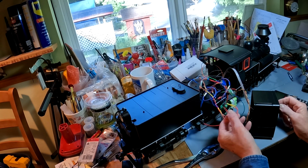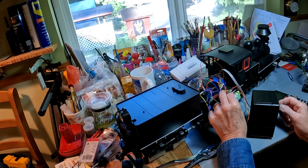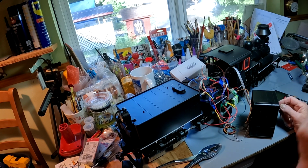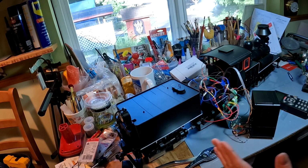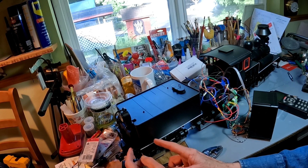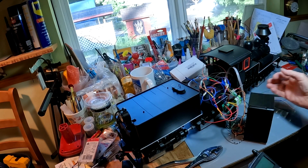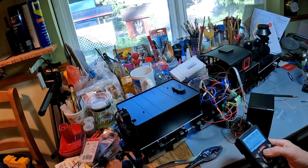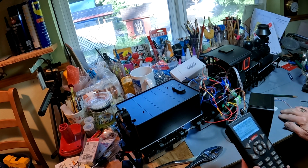I've got the forward and reverse circuits here wired up to the Revolution. Now the soundboard is a Phoenix PE9. Had a little bit of trouble getting that to chuff until I remembered that the speed is what controls the chuff. So as it sets, I turn the main power on. Right now it's in the charge position. Turn that on. Now, my battery pack here is an old one. I don't know how well it's going to last. However, when I do bring it up to like 10 miles an hour, it will engage the sounds normally. There it goes.